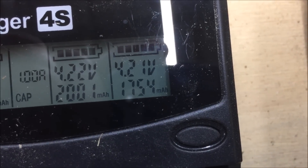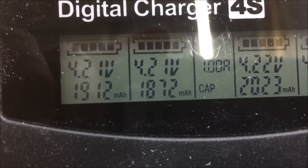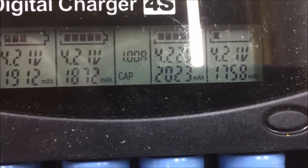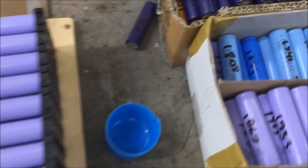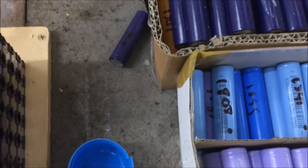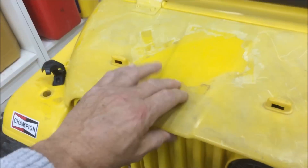Some over here have only got 1754 milliamps, so that's too low. There's one at 1872 milliamps that hasn't quite finished fully charging yet. Basically anything above 1900 milliamps is okay. Anything below that I put in a separate pile, and anything below about 1500 goes in a different container — they're still good for other projects, like my daughter's little car. I've made battery packs from batteries rated 1500 to 1900 milliamps and they're still all right for that sort of stuff.